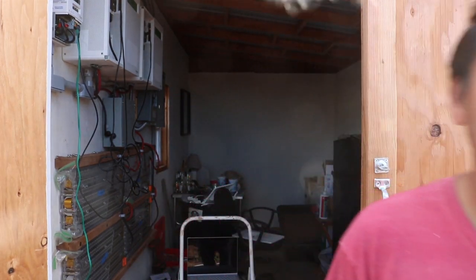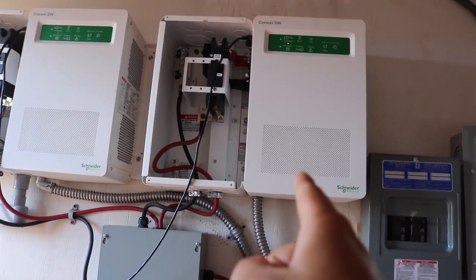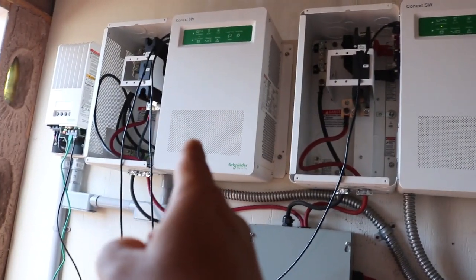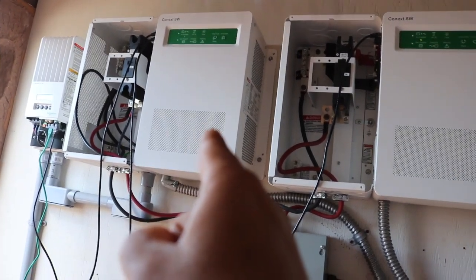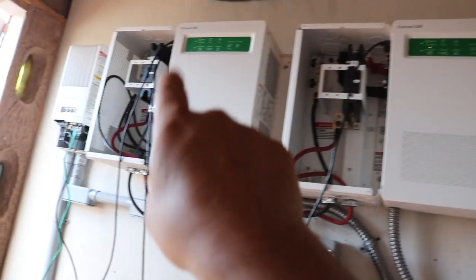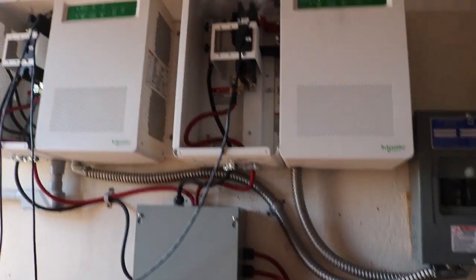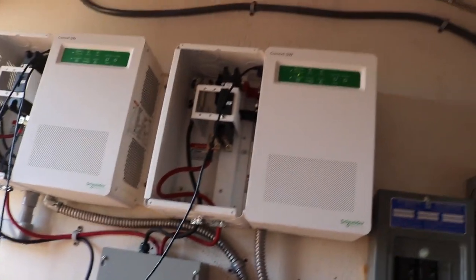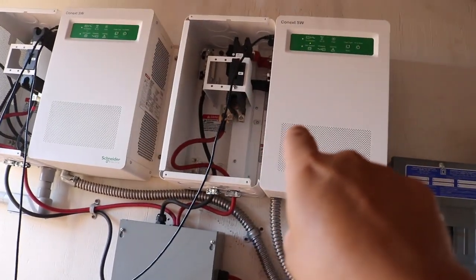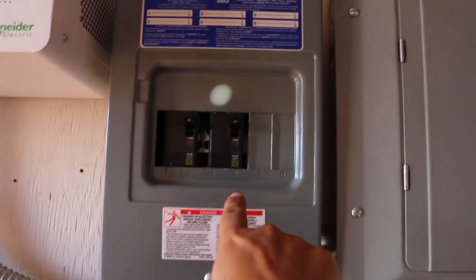Let me take you inside and show you what's going on. In order to get these working together I had to rename these. So now this is inverter one and it is the master. This is now inverter two and it is the slave. So once I got this upgraded and this one was shut down, luckily when I plugged it back in I was able to see it again. Then I upgraded that. Once those were upgraded that fault cleared. Then I made sure that the settings were correct - I changed the name on that to master, changed the name on that to slave. I also changed that to search mode, and then I was able to power it up. And now we are running on both inverters. I got the breakers both on and everything is powered up. Running really smooth.